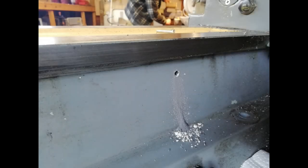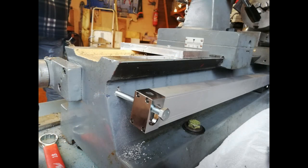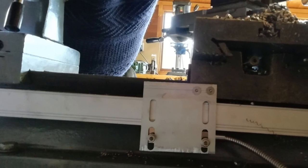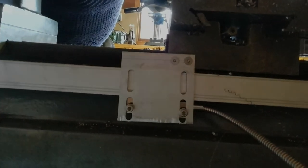The Y-axis — the longitudinal axis of the bed — is much easier to fit. I drilled and tapped two holes and found that the metal is only about six millimeters thick, and some of that thickness is actually a weird plaster. It was easy to fit some studs with nuts to hold it firm against the bed, with washers and nuts behind the DRO and washers and nuts in front. Alignment was done the same way as for the X-axis using the DTI — threaded nuts and washers for the in-out adjustment, and slotted holes for the up-down. Attaching the read head to the cross slide was just a question of dropping a 6mm plate from the end of the saddle down to the read head and drilling and tapping some holes in the saddle.